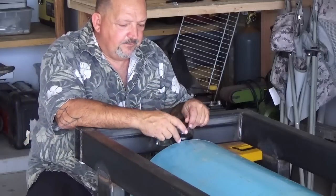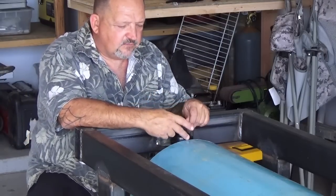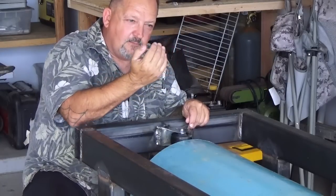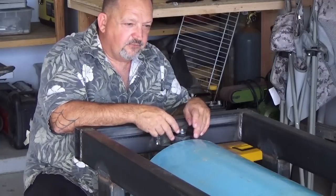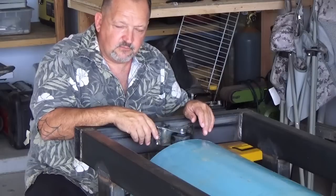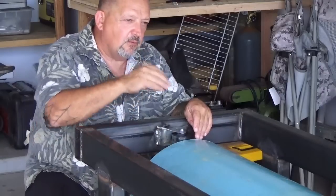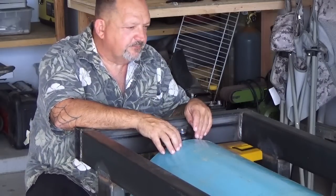It's going to keep the end of the trommel. It's going to rotate. While it rotates, it's going to be spinning on this. As the far end of the trommel is going to be elevated, gravity is going to want to make the trommel work its way down. This will prevent that from happening. So the four rollers on the bottom will keep it spinning at a nice steady rate, while this one roller here will keep it from wanting to move forward too far. It'll keep it stationary from a vertical perspective.